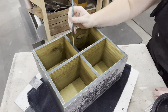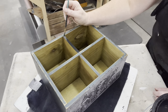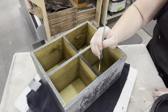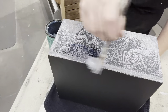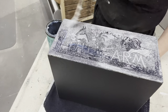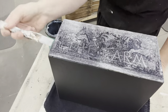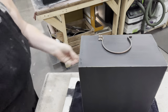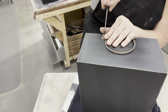I went ahead and distressed the sides, bringing it down all the way to the wood just to give it some distressed look. But now I need to go back in at the top — the little slats are painted blue still. So I need to go in and paint these very gingerly by hand. That's a lot of taping I'd have to do, so I'm just going to go in with a small paintbrush, paint those black, and then seal it in with polycrylic. This piece actually had these rusted-colored handles on the side, so I'm going to add them back onto it.